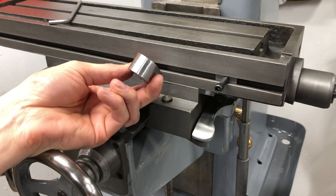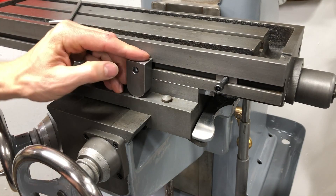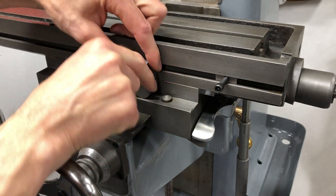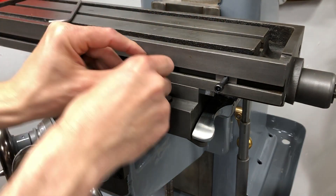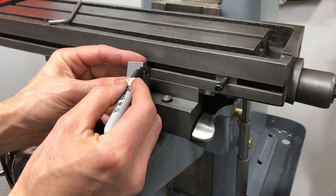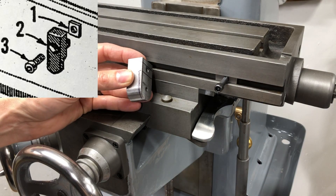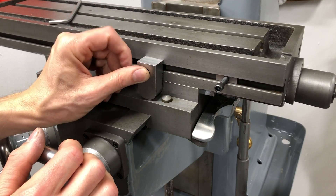A little bit of filing and the radius turned out pretty well. The last feature we need to put into this piece is to keep it permanently straight up and down — this button is not easy to push, and if we just bolt it up there like this it's just going to get pushed out of the way. So we're going to key it in to the T-slot and relieve this material. You can see the picture of the original one was exactly like this, and that will keep it permanently straight up and down riding in that T-slot.